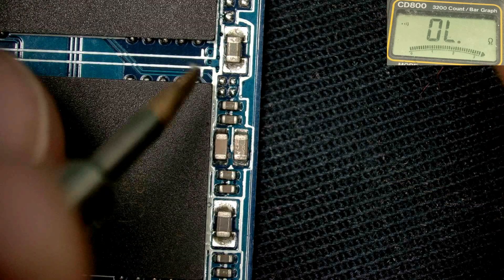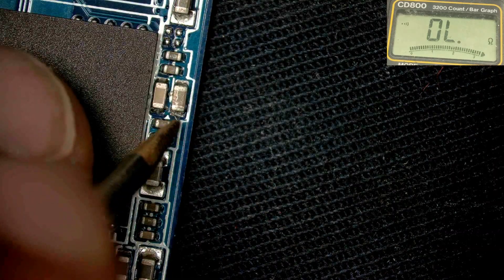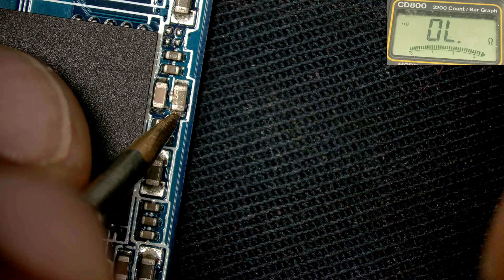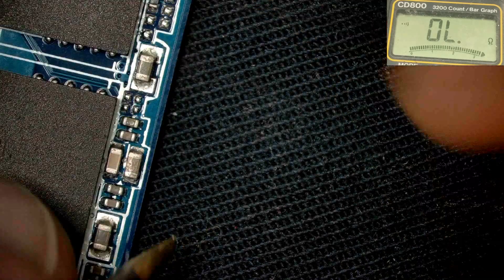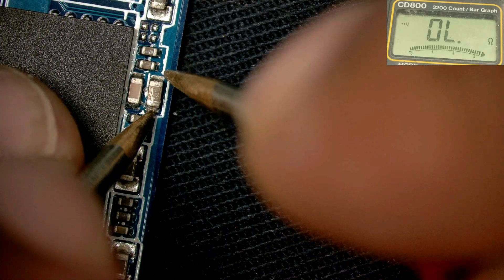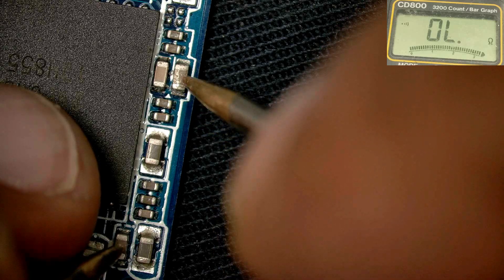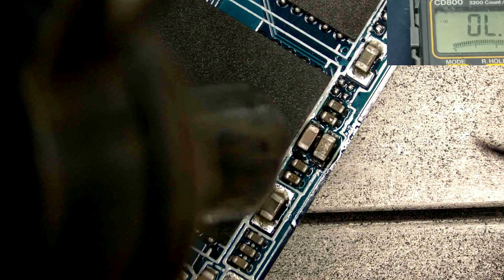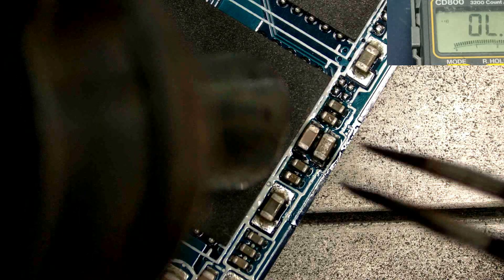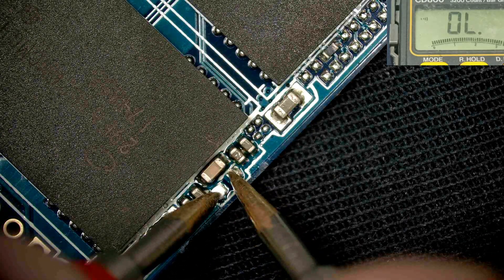Check this here - this one is showing short. Check again - this one is showing short. And this is the problematic capacitor. Here is also a little burn spot and you can see this - short, here is showing 0.8 ohms. Let's open it and check. This capacitor condition is not too good - now the short circuit is open.